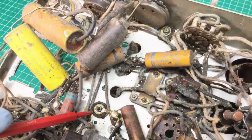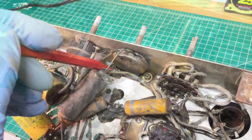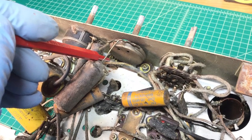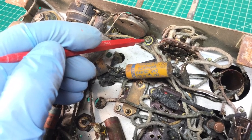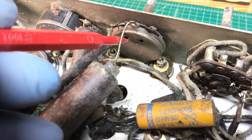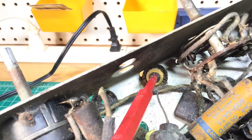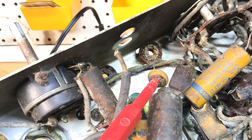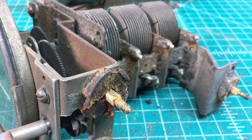There are only three fasteners that hold the tuning condenser in. Here are the two up near this taper — which I believe is the tone control — that tapered in my way, so I took the time to remove it, cut those leads going to it, have that documented for future reference, and just took all that loose.